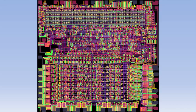As we saw earlier, this is the inside of the 6502 CPU. Let's take away the 6502 wiring and see what's inside the Scott CPU. The first component is the control unit, which is kind of like a captain in the army. It receives its orders from RAM in the form of an instruction, and then breaks that instruction down into specific commands for the other components. One of the most important components under the command of the control unit is the arithmetic logic unit, or ALU for short. The ALU is what performs all the mathematical operations inside the CPU, such as addition, subtraction, or even comparison, like we saw earlier.